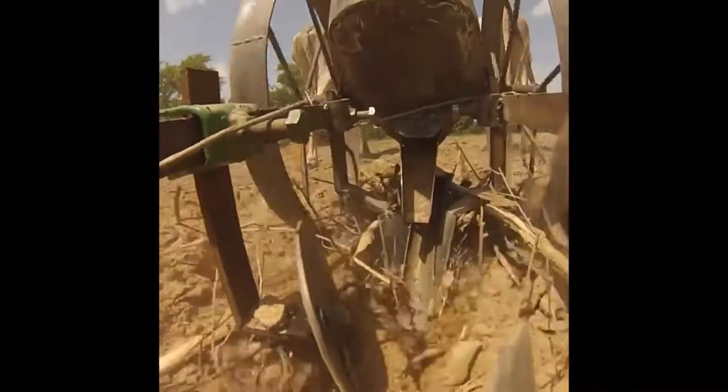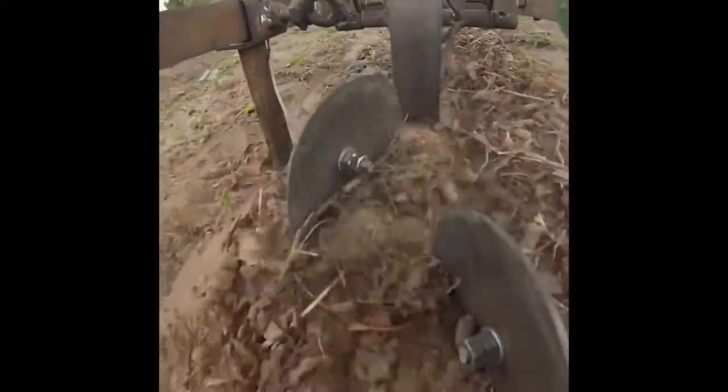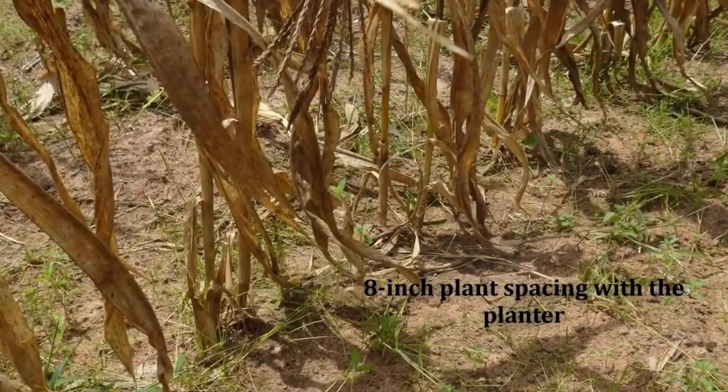We developed an innovative furrow opener for better seed placement. We developed concave disc furrow closers that improved residue flow and greatly reduced plugging. We also reduced the width of the press wheels by 50% for more localized pressure in the narrow tillage zone.